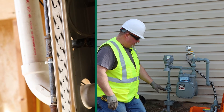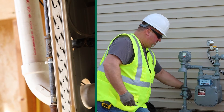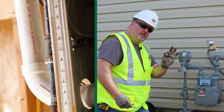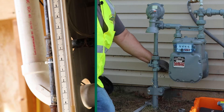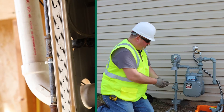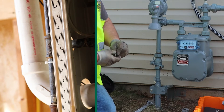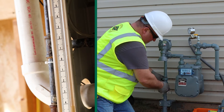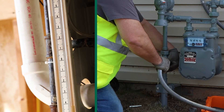Now let's move to the inlet side, the 8277 ball valve. I'm going to take our tamper-proof key and on the back side we're going to remove our dust cover. As a safety measure, we're going to make sure the stem is all the way in, not allowing gas to flow through our front port. Using our tamper-proof key, we're going to remove the front fitting with no gas escaping. With the plug removed, we're going to install our quick connect.